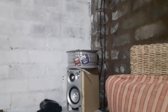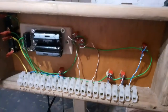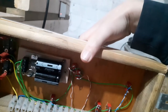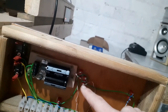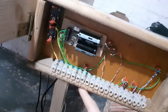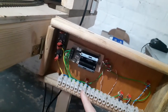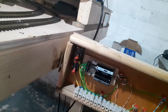All the points just have two wires going off to the back of the switch to the two terminal blocks. I'm using ethernet cable here — not necessarily rated for the correct current draw for point motors, but as it's only an instantaneous flash of voltage I've never had them burn out. I bought a 100 metre roll of Cat5 for £12 on eBay so I'm never going to run out. The positive comes from the CDU to the center of all the switches. The negative goes to the green bus wire going all the way around the layout to all of the point motors, and the positive will run as a short bus from this panel to the fiddle yard control panel.